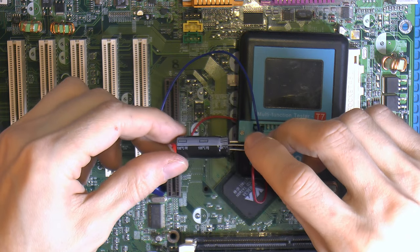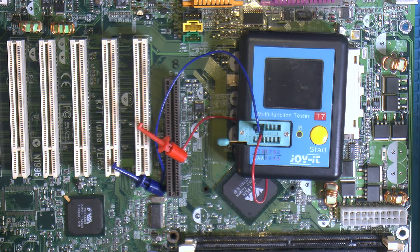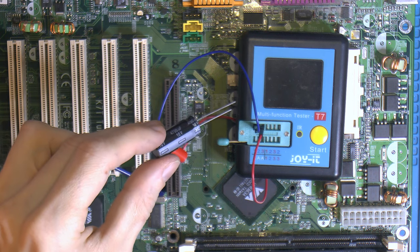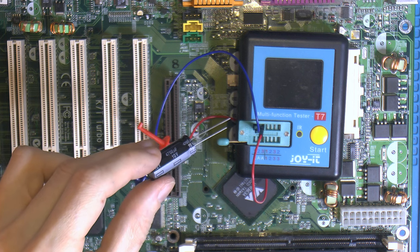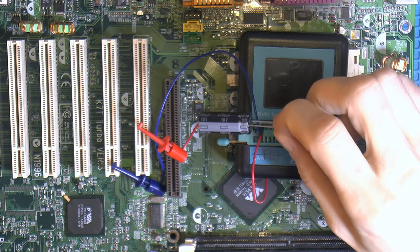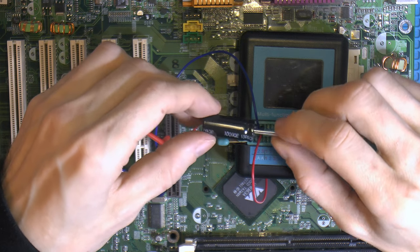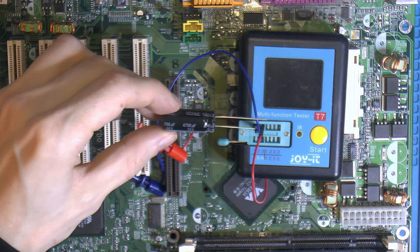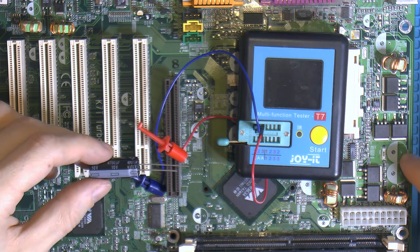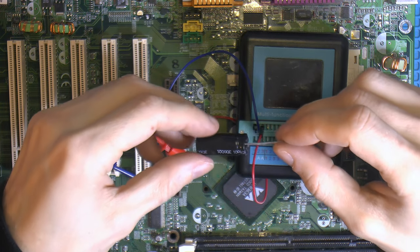So this is a new replacement, Panasonic low ESR. It's rated 10 volts instead, 4700. And I'm gonna use them over here too, because buying 10 of these with tax cost me about $15 or $16. And buying them separately below 10 units, because you get that price reduction as you go up in volume, so if I bought less than 10, they cost almost around $2 a piece. So I bought to put some over here too, because it doesn't really matter that much if you have 4700 or 3900 over here. We need the same voltage rating anyway.